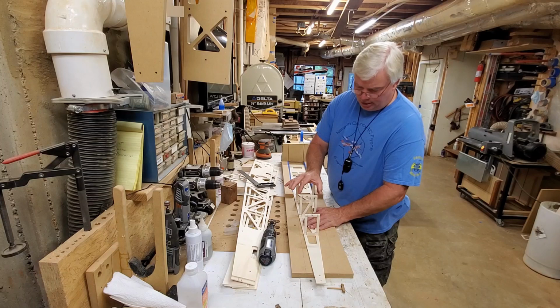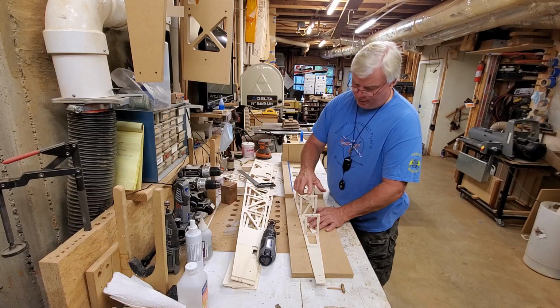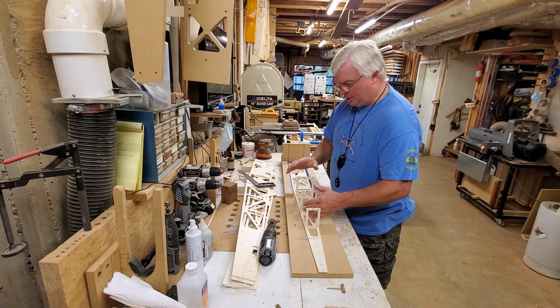You can be a degree or two off, because when we're gluing the sides on, remember, it's just tacked on, so we can kind of flex it back and forth a little bit. If you're not exactly 90 degrees, you can pull it into shape. Of course, we don't want anything pulled along ways, because then you will add stress to the plane. It'll be preloaded, in other words. So get it as close to 90 degrees as you can get it,